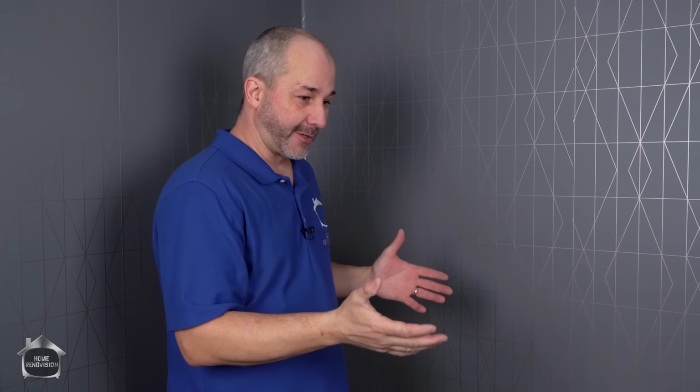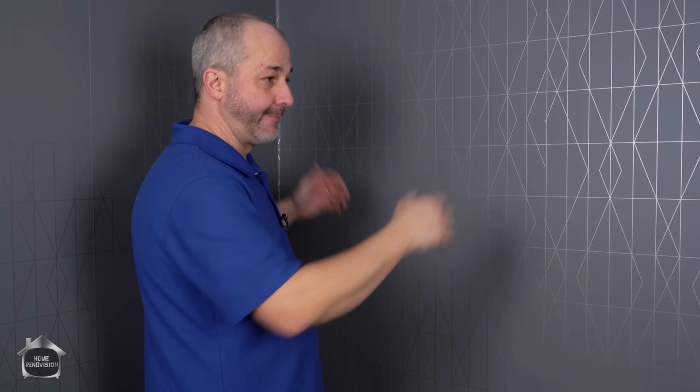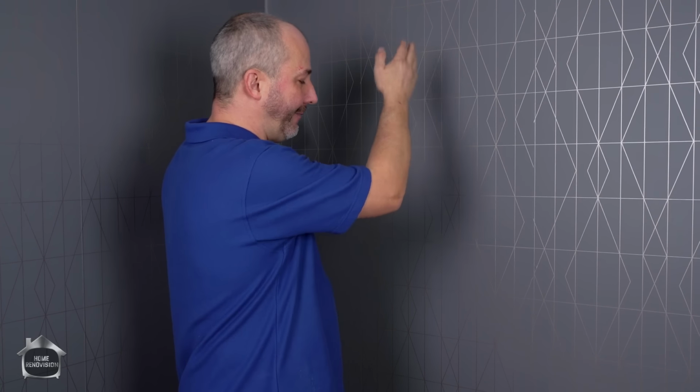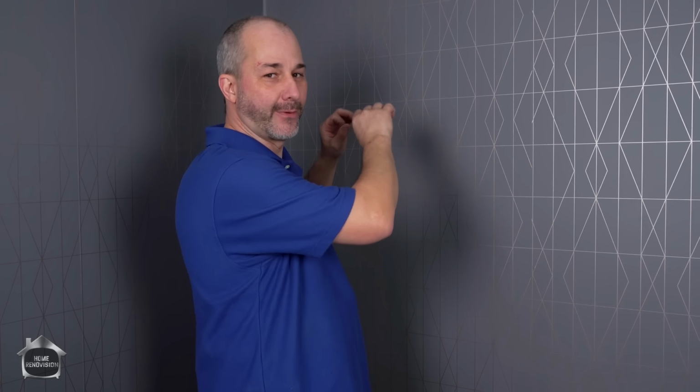So the basic function is you need to have a gable on each side and then a rod. Now the rods that they sell in most situations in homes, new home construction, are very thin. They go inside each other, kind of like a shower pole. What I like to do is buy the step up. It's a heavier gauge steel. We'll show you that in a little bit. And then that can go across there without the need for middle supports. So you don't have all these brackets going on that are confusing and ugly, because it'll transfer all the load of all the clothes over 6 feet, no problem.